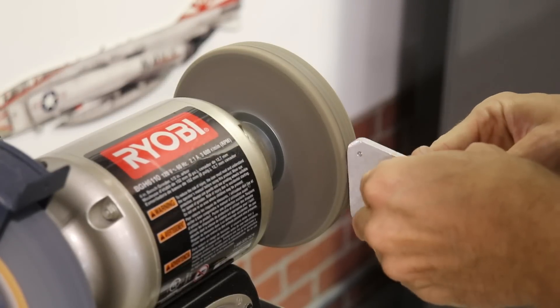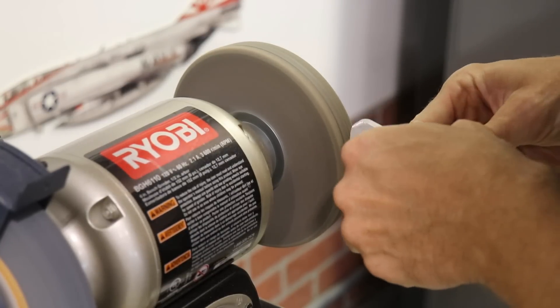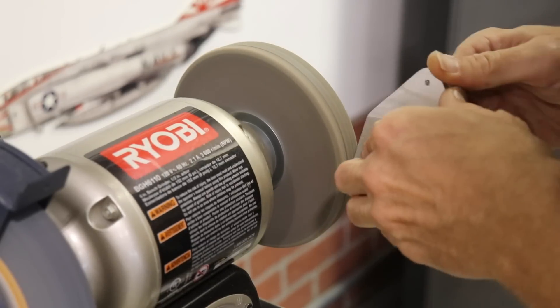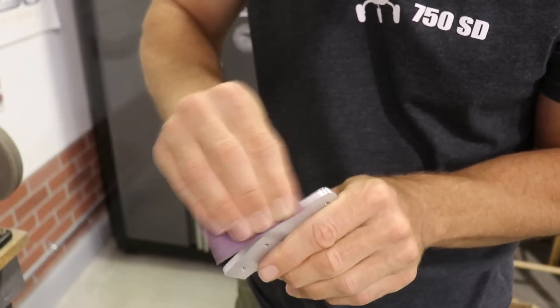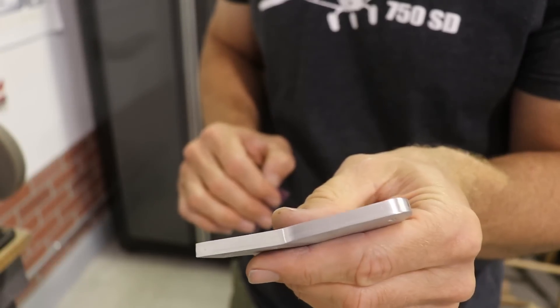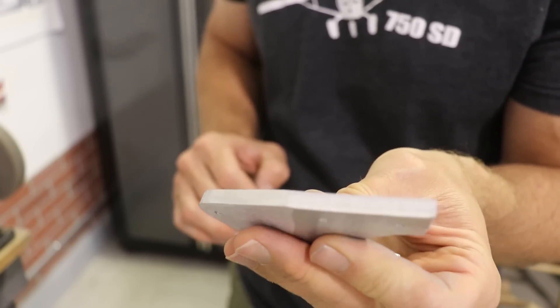That was a long overview of where I'm at — I just wanted to show the list of steps I wrote out. Now let's get started. I'm working on the rudder mounts first, taking this big quarter-inch thick piece of aluminum and cleaning up the edges. After the scotch-brite wheel I finish with 400-grit sandpaper to polish the edges and break the corners. You can see the difference between a polished edge and the rough grooves before.